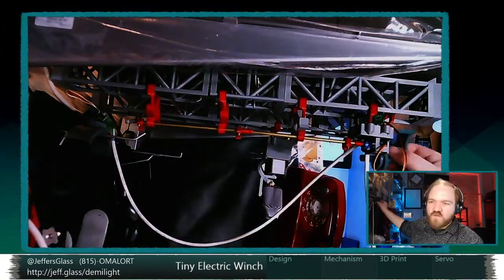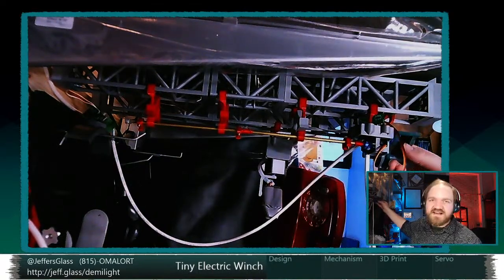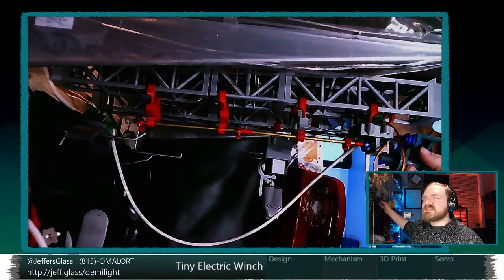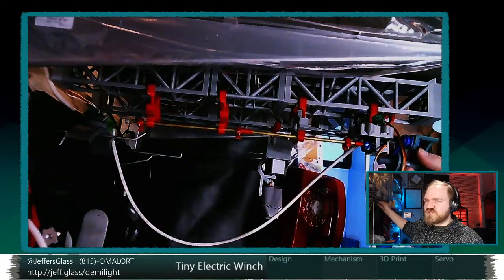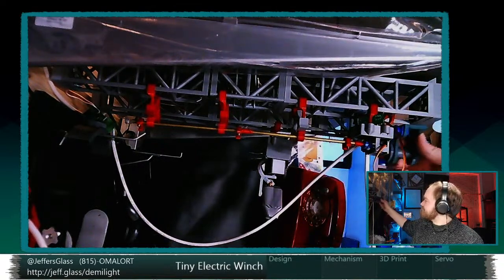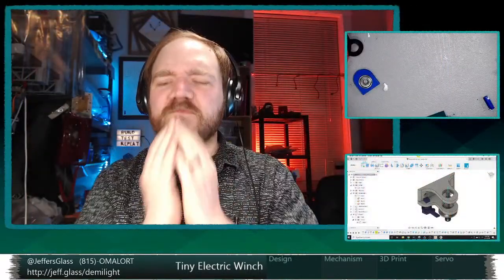Thomas, I don't know if this is something you've run into in your projects. If we're going to have two winches driving one truss, especially if they're just little stepper motors, it'd be really nice for them to be very nicely in sync. And I'm sure synced in code would be synced enough for our purposes at this scale. But I'm wondering if it's necessary to run both steppers off of the same driver, which is maybe too much, but maybe they run off of identical control signals to a couple of StepSticks or something like that. So more things to think on for the future.